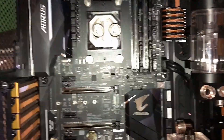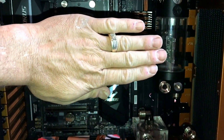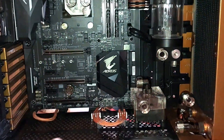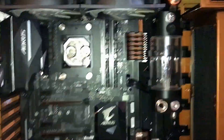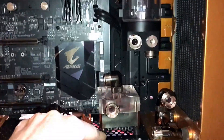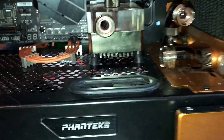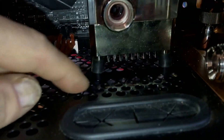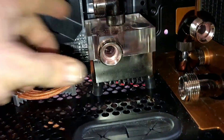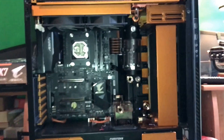This is the motherboard installed. I don't know if you guys remember, but my reservoir was mounted here before, right here, and I got my video card here water cooled. So I'm moving everything over there just to change things up a little bit. I mounted this DDC pump — if you notice, the grommets are kicked left and right just a little bit. That's because I utilized these factory holes to mount it, and that thing is mounted really good.